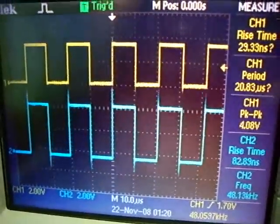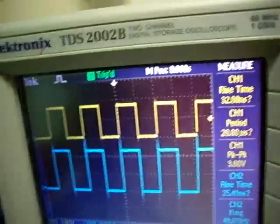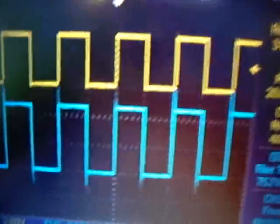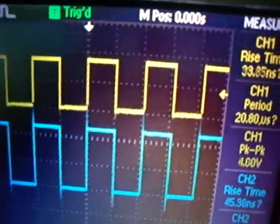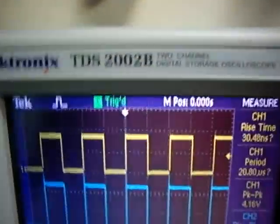Let's shift it so it's a little bit more clear what's happening here. You can also see that the signal has spikes on the edges, which are quite heavy. It comes from signals which are not very good — if you use such cabling as I do here, this chaotic cabling, it will always cause the signal to behave this way.